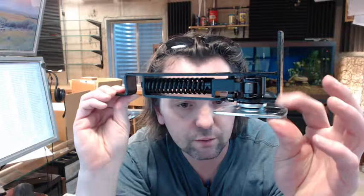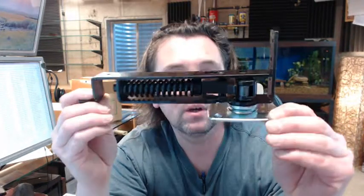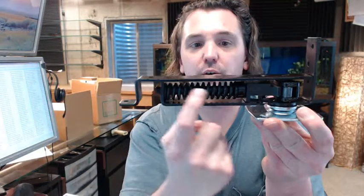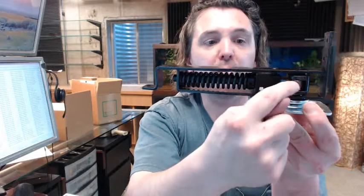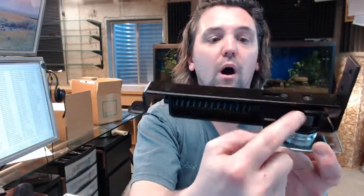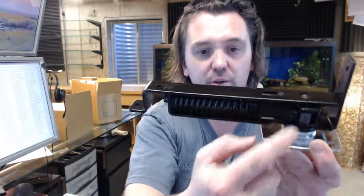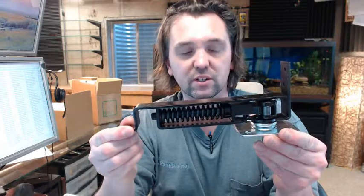Floor pivot here, pardon me, the floor plate, okay. Spring assembly here, adjusted with the tension collar here, and I'll go over that in a moment. The hold open mechanism is achieved with these rollers and this hub that has a bird's mouth shape cut out to it, and I'll go over that in a moment as well. So here's the bottom spring assembly.